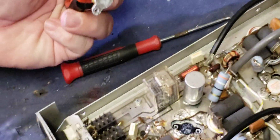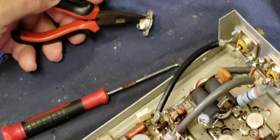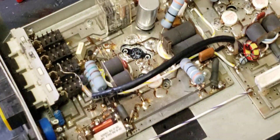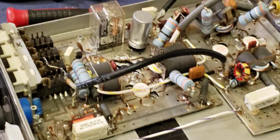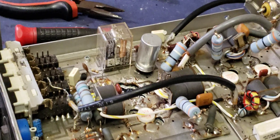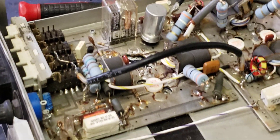It's good to have some paper towel to lay it on. I'll just lay them upside down for now. That's one — three to go. Hopefully that helped. I ain't gonna make you sit here and watch me do all of them. Removing transistors out of a homebrew-style copper plane board amplifier — like a Fat Boy, Boilermaker, X-Force, or Gatekeeper — is ten times easier, because we usually take precautions to make the pills easier to remove. Hope this helps. Gatekeeper's gone, bye bye.